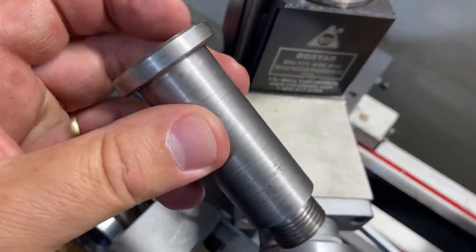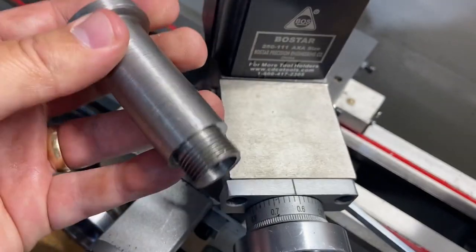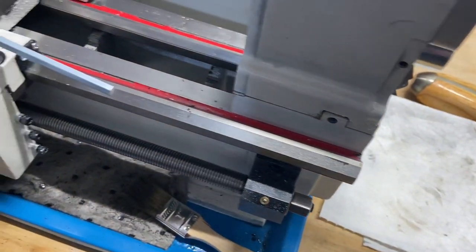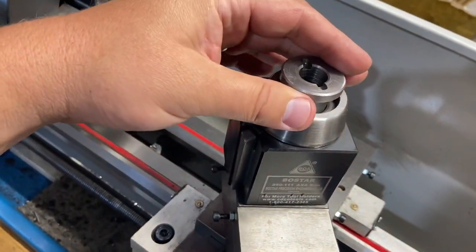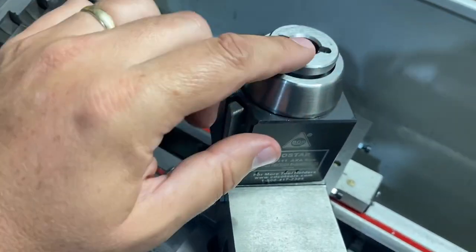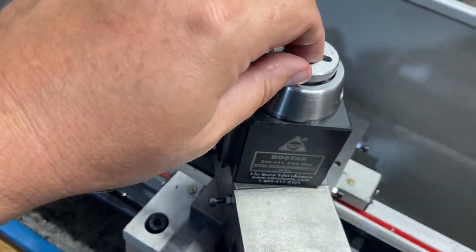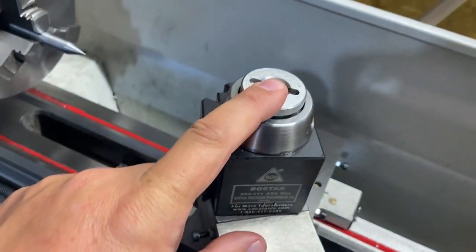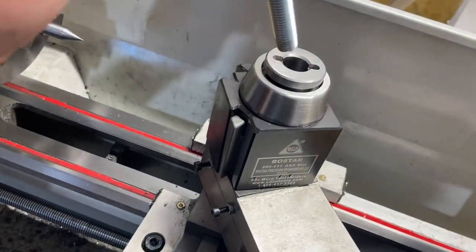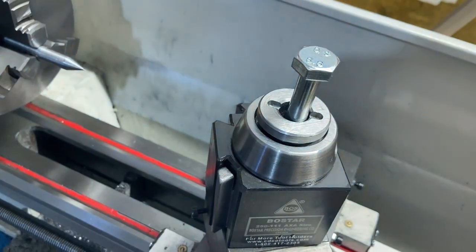What's 300 thou in an inch? Well, that's the top inch, 300 thou. Anyway, so we get these drilled out, and then this can fit down in here, and I'll screw that down to where those spacers are. You don't want this tight against this or this won't be able to spin, but you do want to cut some of that slop out. So I'm going to put some spacers under there, and then the idea is to find some sleeves or bushings, and I'll screw this in here to hold the whole thing down.